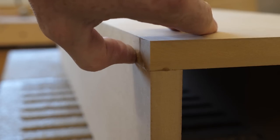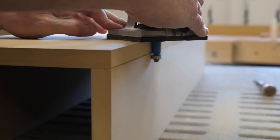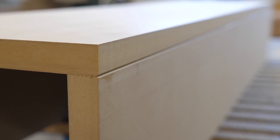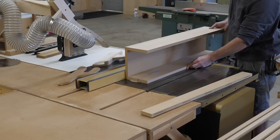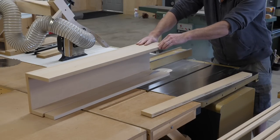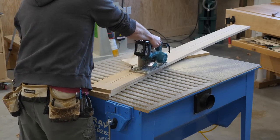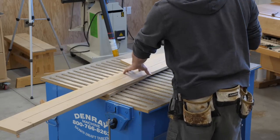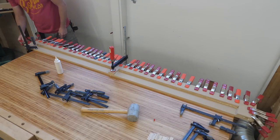The legs and shoes are now dry enough to deal with the overhang. This is a flush trim bit with a v-groove — it's designed to hide the seam by creating a groove right at that point. This way, as the years go by and the paint cracks at the seam like it always does, it won't be noticeable. Think of this like a control joint in a concrete slab. If I've done the math correctly, this cut will make sure one side of the leg will rest on the shiplap and the other will rest on the bricks. The top is two layers of MDF. I'm making some relief cuts in the bottom layer of the top — this will make it easier to glue up because there's less total glue surface area to clamp. Since this seam will show, it is super important that the glue line be invisible, hence the relief cuts and lots and lots of clamps.